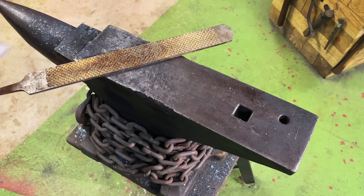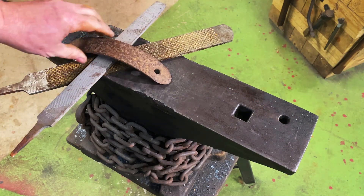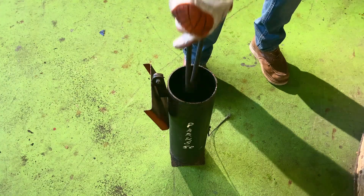There's also the use of repurposed steel such as old spring steels, plow steels, rasps, files — that sort of thing. While it's not something I would use to make and sell, it is certainly steel you could use as a beginning knife maker to learn the craft. I don't like it because I don't know the exact make of the steel, therefore I can't do proper heat treating. But basic high-carbon steel is not that expensive and you know how to heat treat it — that way you're not experimenting and getting frustrated when it's not heat treating properly.